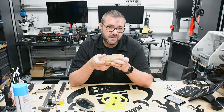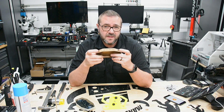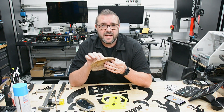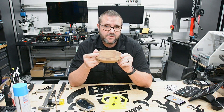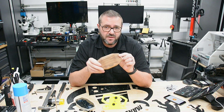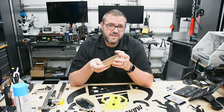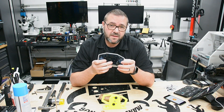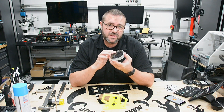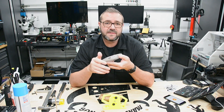Considering the symmetrical shape of the object, we have shoulder button holes perpendicular to the shoulder faces, rear ports with access perpendicular to the rear face, and a power switch similar to the shoulder buttons but located on the front right cheek of the body. Although these are all different angles, fortunately they're all parallel to the face — mainly because all these ports integrate with components mounted on the circuit board, which is also parallel to the face.